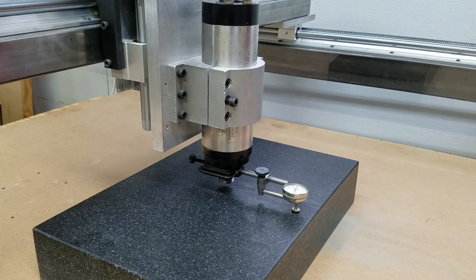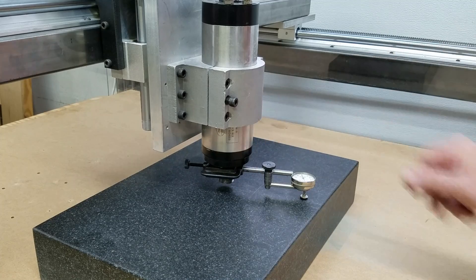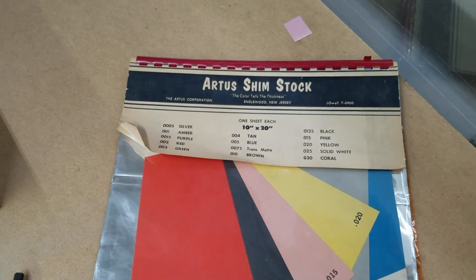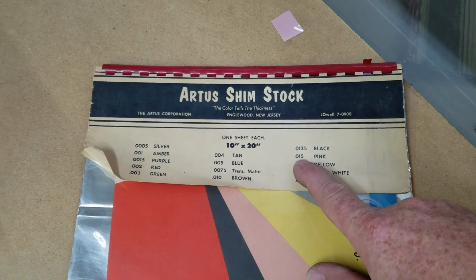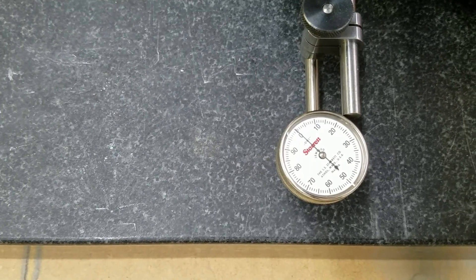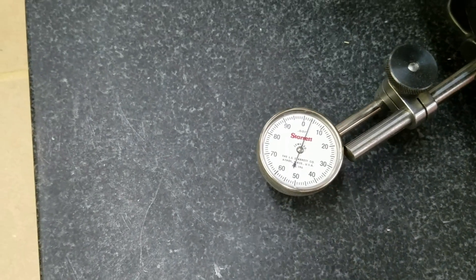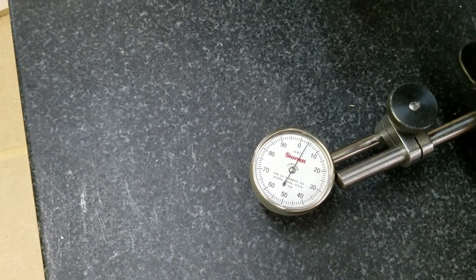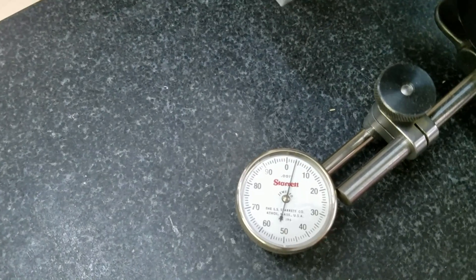So all we can do is compensate for it — I'll get some shim material out. About the best place to accommodate this is going to be to shim underneath these screws here on both sides and try and bring them out. This is the shim material I'm using; pink being the biggest in this package, that was a 15-thousandths shim. I've got the indicator mounted back on, let's see how she does. I can tell you already that's better — it's actually going the opposite direction. It was dropping 30 or 40 thousandths in that turn; now we've gained about 4 thousandths.